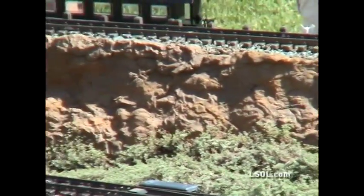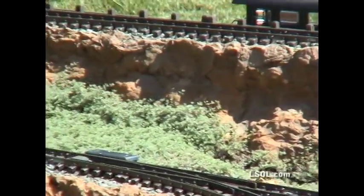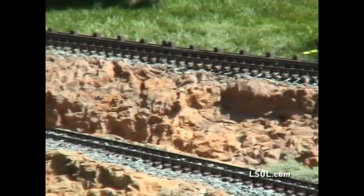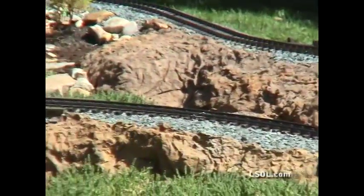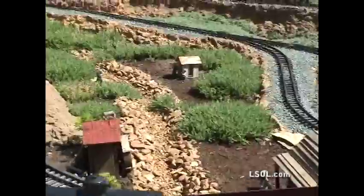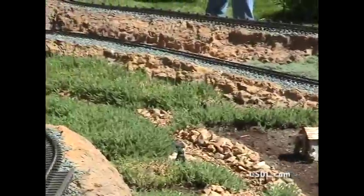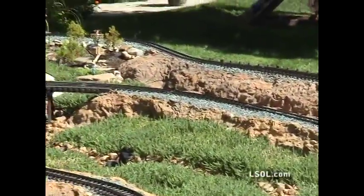And while the mortar was still wet, we pressed wrinkled aluminum foil against the mortar and let that sit and dry, and then peeled the aluminum foil off the mortar at least 24 hours later. Prior to putting the aluminum foil on the wall, we coated the aluminum foil with vegetable oil, PAM, something like that, non-stick, so that it didn't adhere to the mortar.